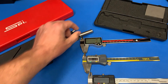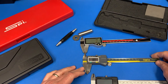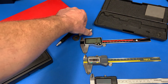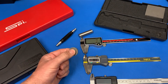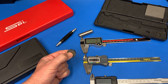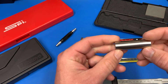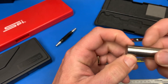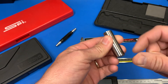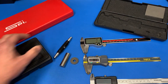Okay, got a couple different standards on the bench today. Someone shared a conspiracy theory with me that they thought some of these brands of digital calipers might be rounding to a whole number at the size of a common standard. I hope that's not true, but it wouldn't be that hard to do — like, if it suspects you're using a 1-inch standard to test them, maybe it rounds to 1. In case that possibility even exists, I have a dowel pin here that is 619 thousandths. And I believe this is also exactly 2 inches in length as well. And then I have a 4-inch standard as well.